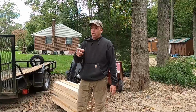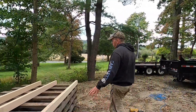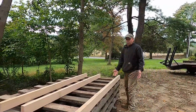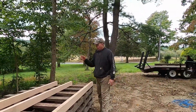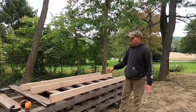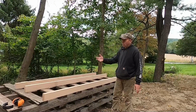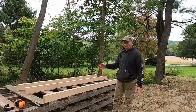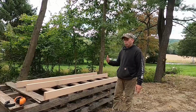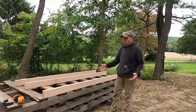And get laid out here and turn around here and see what we got. We need a flat surface, so we have our stack of lumber pallets over here, and we're going to set up on top of here. It'll be easy to do, and start getting them nailed up. We're going to do the bottoms first, putting the white oak on the bottom. I think we're going to use 5 of them on the bottom, and that's all. We'll flip it over, nail, I believe it's 10 pieces of slats on the top, and it's done.